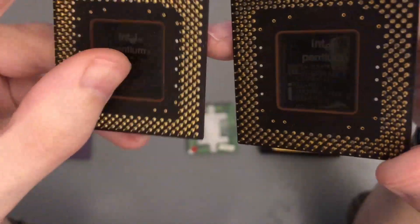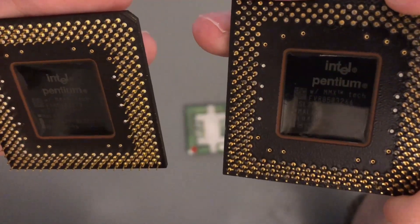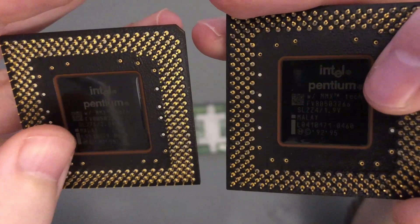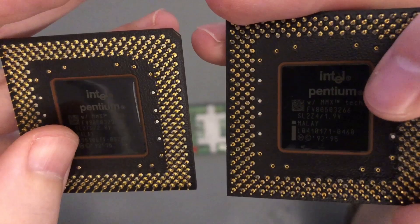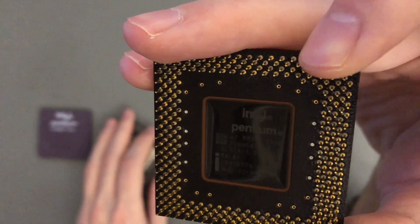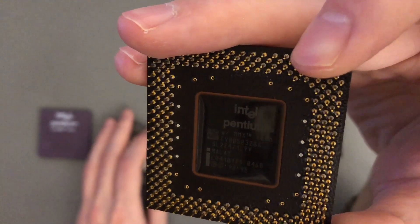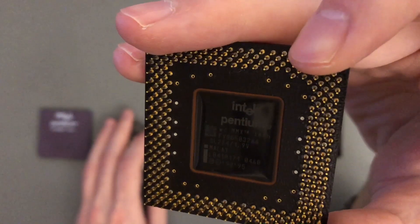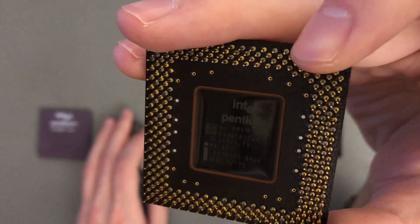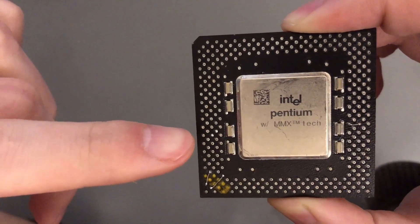On the back side the die is a little bit bigger — which makes sense as the original is 350 nanometers and this Tillamook is 250 nanometers. The other difference is the Vcore: the original is 2.8 volt while the Tillamook is 1.9 volt. The Tillamook is also rated for an I/O voltage of 2.5 volt versus 3.3 volt on the original. This could be a problem since no desktop motherboard actually offers these lower voltages, but as this is a mobile chip, Intel likely set the voltages low just to reduce power consumption. The 250 nm process was also used on Pentium 2 chips, which use a 3.3 volt I/O voltage. In the end I only kept three of the four mods and removed the fourth one, as with my motherboard it caused it not to boot.